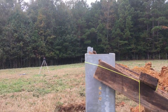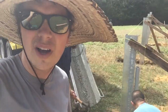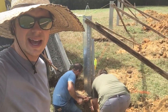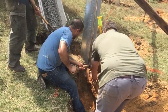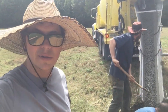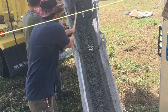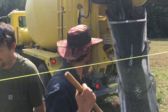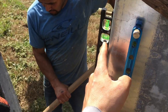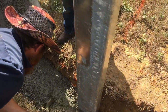There's a little bit of twist even when the concrete sets, but it's nice to start level so you can get things as straight as you want — especially when you're working with a bunch of perfectionists. The concrete truck came early, so make sure you get your conduits in place before pouring concrete, at least that last conduit. We're doing just under a yard per hole. These posts are in the ground and you're going to get charged a minimum if you don't have a certain amount of concrete — usually four yards, not a whole truck. We're using magnetic post levels to cut level; once again there is a little bit of error factored in, but we want them as straight as possible.